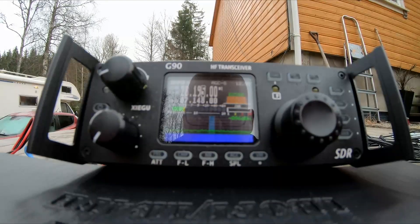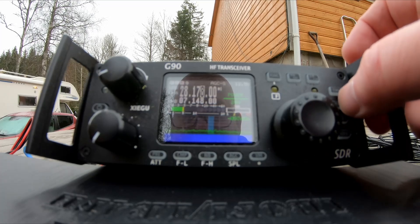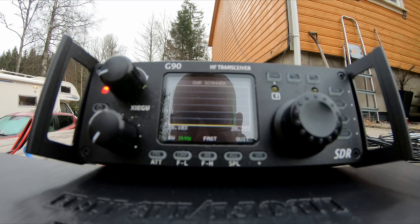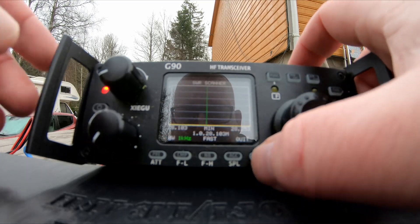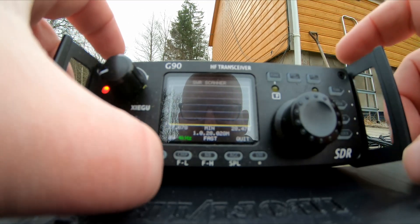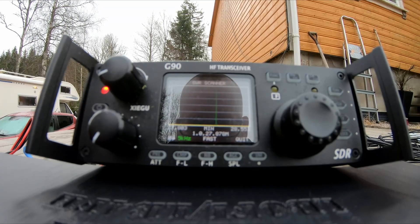We'll check out the radio. We're now at the lower end of the 10 meter band and we'll check the analyzer here. It's a flat 1-to-1 on the lower end of the band. Let's increase the bandwidth to check. I guess that's a dead lucky build because we don't have to adjust anything on this antenna. We got pretty much lucky with the 10 meter antenna — spot on on our cutting, so we didn't have to adjust anything. If we would have had to adjust, we would have cut it to match the resonance point.